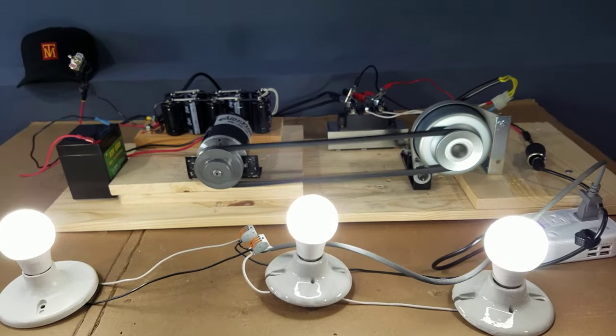And the system does not appear to have any issue with the 750 watts inverter connected to it. The inverter reading is a little off. It should read around 45 watts for the three light bulbs. And I still see no issue with the system when I turn the load on and off.